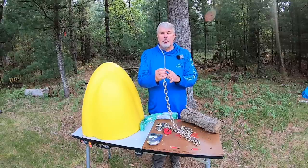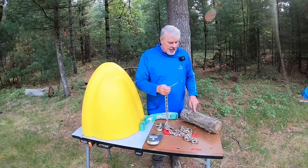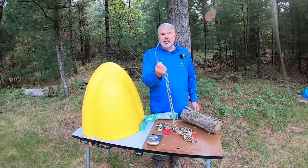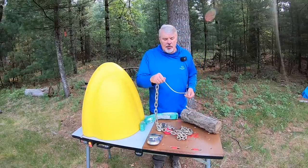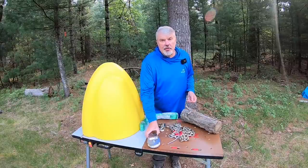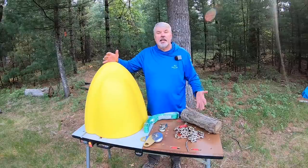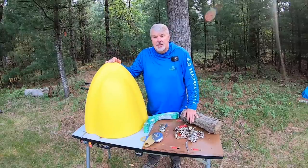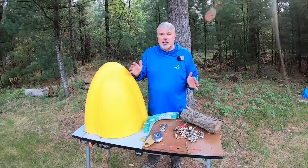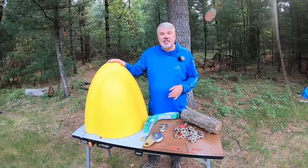Look, and the first thing you wanna do, this one was straight, but the first thing you wanna do when you get this is take a piece of wood, put it around it, and press it. You wanna be able to get something like that so that when you go underneath the log, it's easier. And you get a 13 millimeter snatch block or 1/2 inch snatch block. And in my opinion, the heart of the Forestry kit is this cone right here. It makes your skidding go so easy. You can hit stumps, you can hit logs, rocks, and everything, and it glides right over.